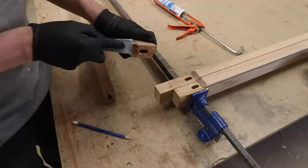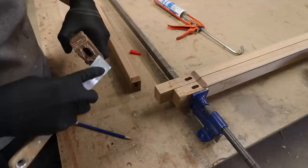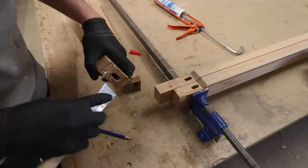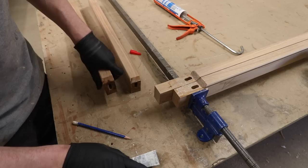I've put plenty on this end grain here because I want it to hold well, but it does tend to soak up the end grain quite a lot, like Cascamite would. But what you'd find with a Cascamite joint is you'd coat all your rails on your door, all the shoulders, like I'm doing here, anywhere there was end grain on a shoulder, and really layer it on. And by the time you've coated that rail up and put it in the door, and then coated all the other parts of the door and got it assembled ready to put that last stile in place, you'd look at the shoulders and they'd be completely dry of glue. You'd end up re-coating them with a load more Cascamite, and all it's going to do once you squeeze that joint together is squeeze all the glue out of the joint, soak up that end grain, and it just makes for a weak joint, in my opinion.